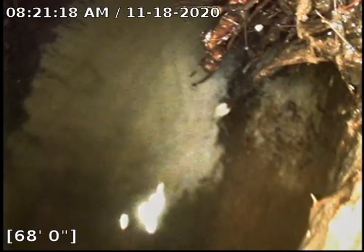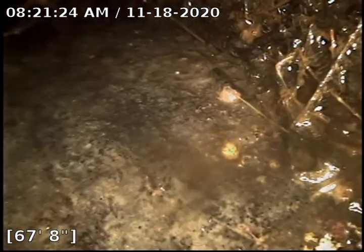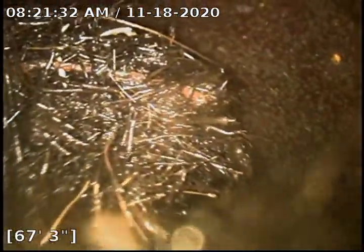I am at the city tap, 68 foot out. We still do have a little bit of roots here, but these tap corners are pretty tricky to get a blade to cut properly. I did get this cleared up a lot better than it was in the previous video. There is still quite a bit of a root ball there that my machine just wouldn't grab onto.